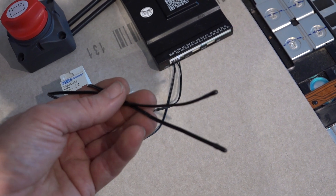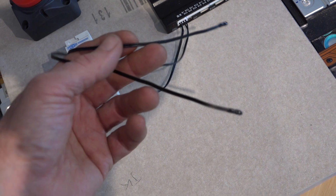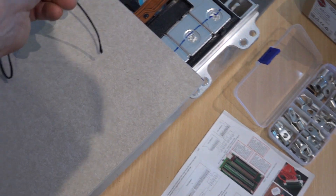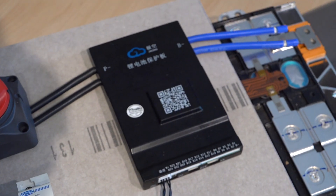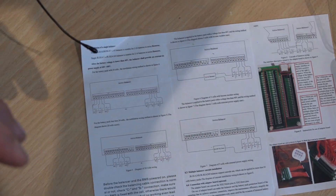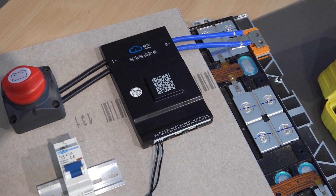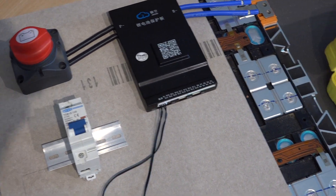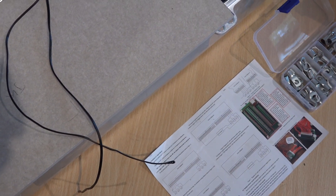Coming out of this thing is a couple of thermistors - one's an ambient thermistor for lead acid charging because your lead acid battery pack needs to know the temperature, and the other one's the battery temperature, so I've got to poke it down inside next to the battery. You can monitor your temperatures and shut the thing down if the battery gets too hot - it's a safety monitoring feature of this JK charger. There are full instructions here and I'll go into much more detail when I get the thing working and fire it up. If you've got anything you want to add or advise me on, let me know.